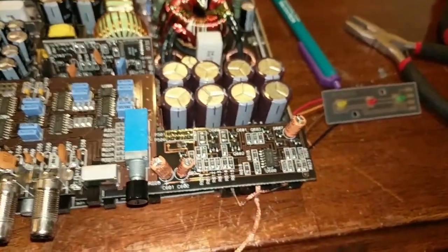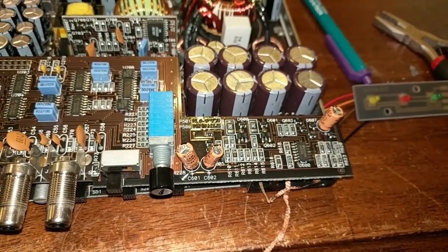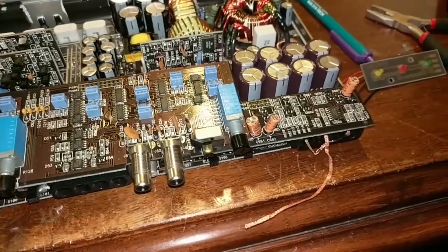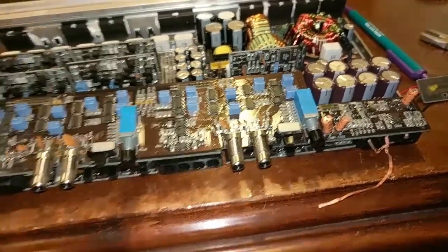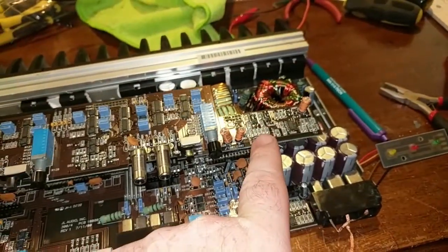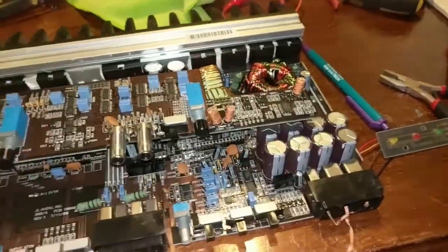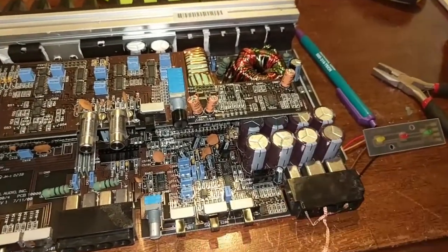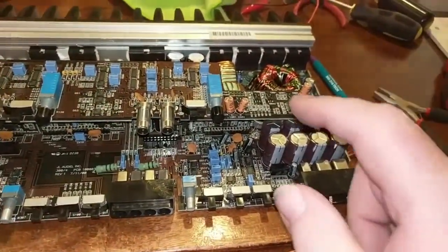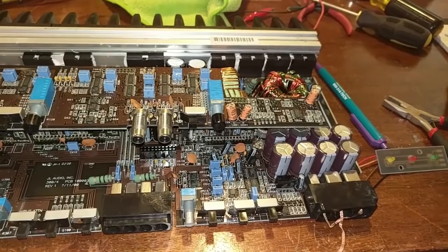So this circuit is not even functioning at all. So most likely that's the reason why our audio is mostly muted. And if you've got a 300x4, then all 4 channels have sound but barely any sound. This is likely why. The 500/1, this circuit's different, and it's part of the remote circuitry. So if it's damaged, the lights don't come on and it doesn't power up. But this one does power up. So that means the circuitry for that is in here somewhere. Anyway, I'm gonna go ahead and make some jumper wires, and then we will meter everything out and try this again.